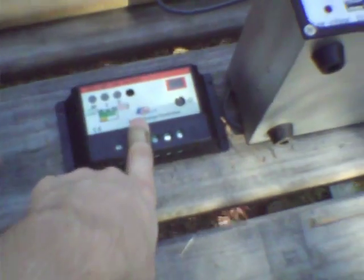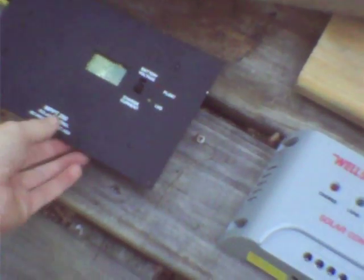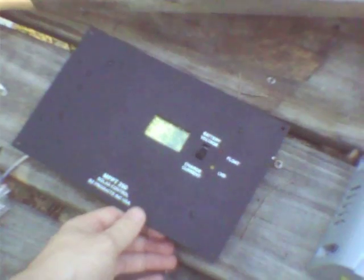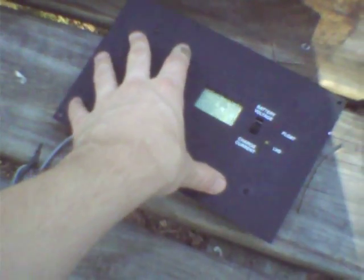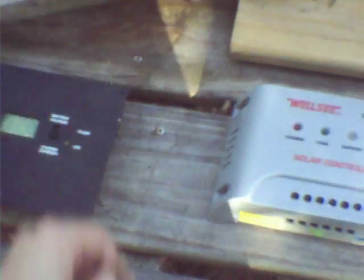The fake unit is crap — don't buy that. The general recommendation for PWM use is under about 200 watts of modules, though that's for much bigger controllers — this BZ unit is only good for about 250 watts, and the bigger version is good for 500 watts, but those are absolute maximum ratings. Once I put these in service I'll do a video on that, because one real problem with these is they don't come with a back box, and if you want to buy one it's 30 bucks. I've got my neighbor who's a machinist making up a panel box from scrap metal.